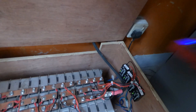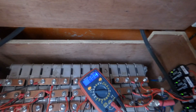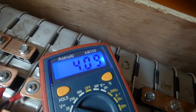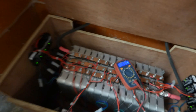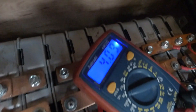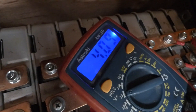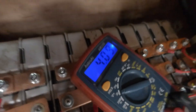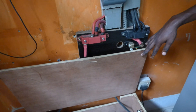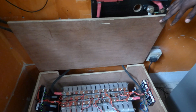So tap and bring your multimeter and get me the voltage from B1. As you can see, 410 from B1. Go to B14 — and it is 409, well 409, 410. So as you can see, the one that was reading 409 is now the one that was reading higher voltages, and the one reading 410 was the one reading low. So it looks like they're pretty balanced.